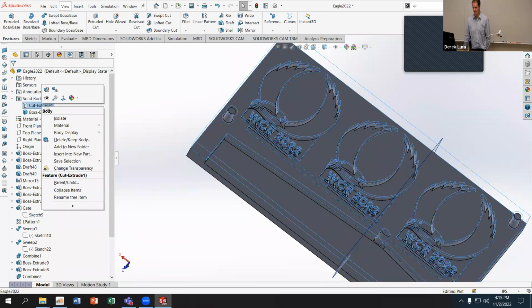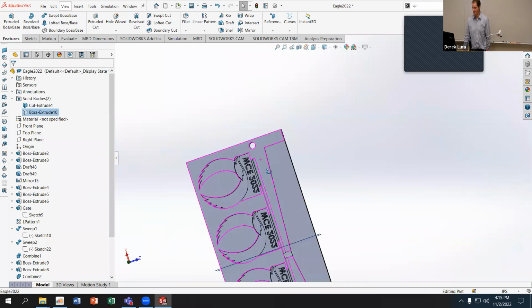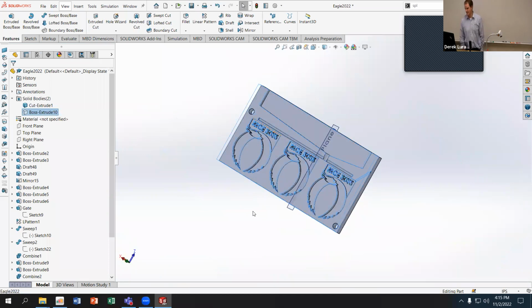And then I have the other side of the mold, which has locating holes, right? And just the negative side of my part. And then that's what I would consider to be a complete mold, where I have the void that I want. I've got gates, I've got a delivery system, I've got a storage system, I've got vents, and I've got locating features.